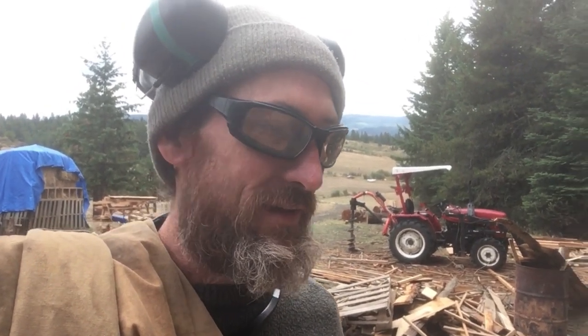The wood stove we bought last year came with 4 feet. They are not attached, and they are not all the same size. So today's project is going to be to grind down some steel that we found in the back 40, or the back, whatever you'd call it, back behind the shed, in the repository of junk. We're gonna grind down some of that metal, drill some new holes, and mount these feet to a plate, put that on the bottom of the wood stove to keep it up off the ground.